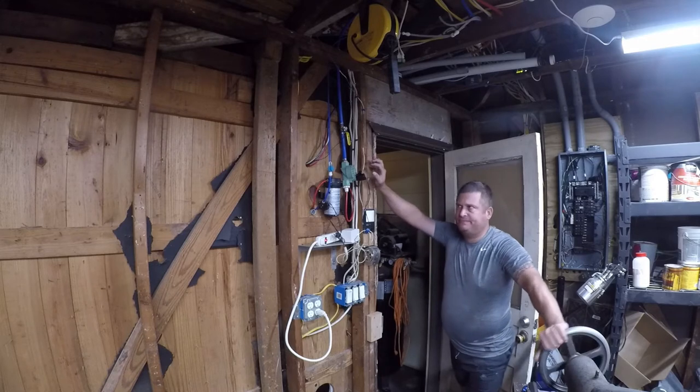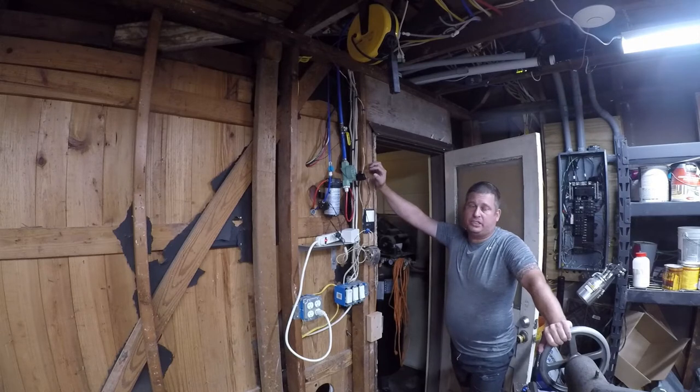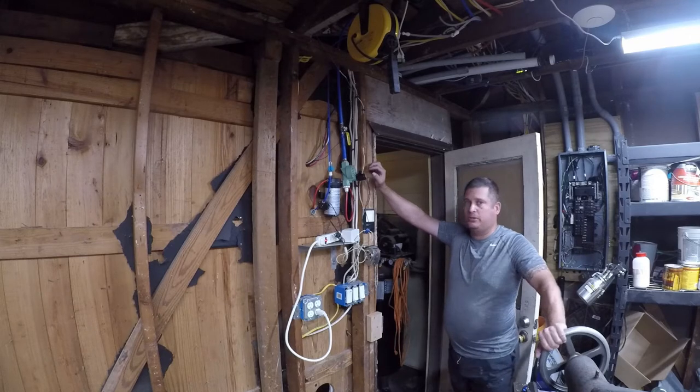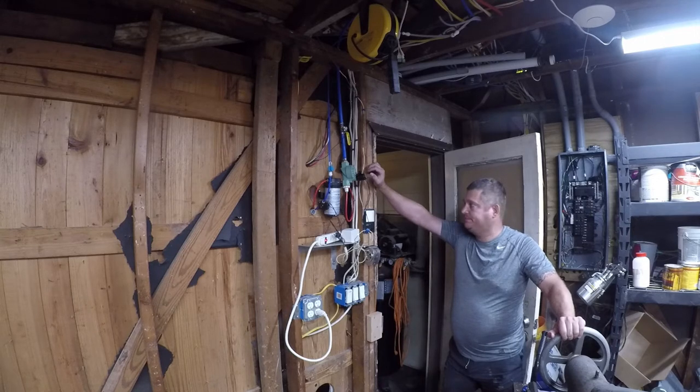Then I found my solenoid was dead. About two months ago I replaced the solenoid and thought about doing a video, but it was a long, irritating, and frustrating project. It transitions to polyethylene tubing that I wish I had never installed in this house because I can't get to it to change it — and it's already leaked once. I wish I had installed 3/8 PEX, which is harder and more durable, but the fittings are rarer than winning lottery tickets.